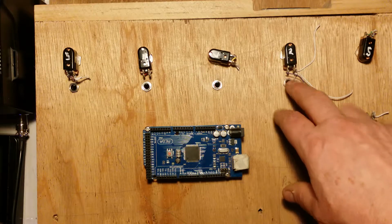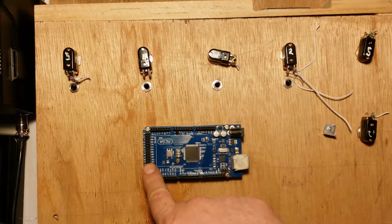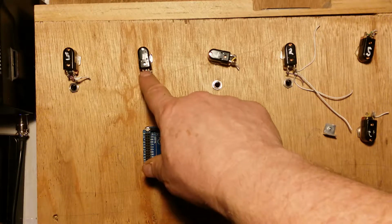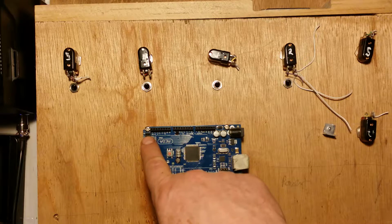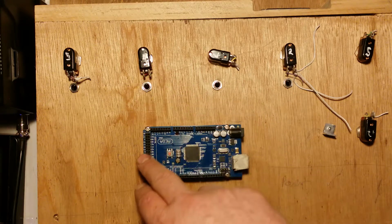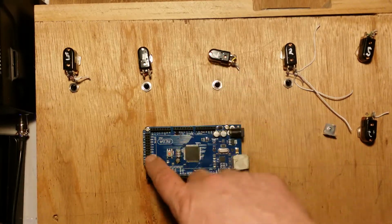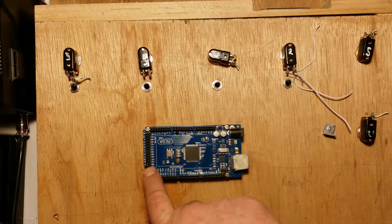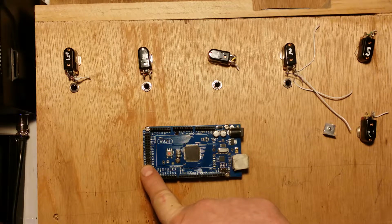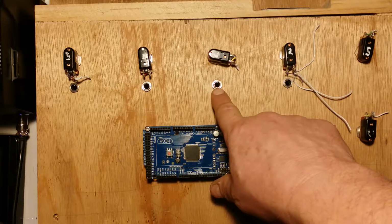If you remember my last video, I said what that means is the control terminals all work on negative, on earth. So these switches will have a common earth, which will be connected to the control terminal for the common earth here, and the control terminals are activated by looking for the switch to go to earth. These are all momentary switches. It's very hard to use latching switches with this kind of setup. You can, but it's just painful. It assumes you're going to use momentary switches. You create the momentary switch circuit, and the board recognises that that control terminal has now gone to earth and activates the program based on that. With the LEDs, it will use a common positive.